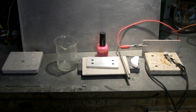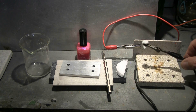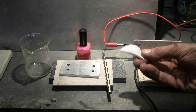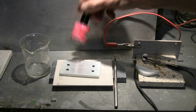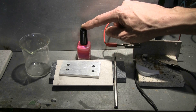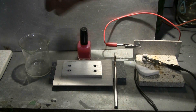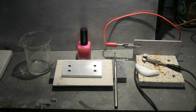In this video I'm going to demonstrate the etching of aluminum. To do this we're going to need a few things: a 12 volt battery charger set up with its negative and positive leads, a cotton pad, a pick, some nail polish to act as an etch resist — it's a very good water resistant lacquer — an aluminum sample piece, and a vinegar and salt mixture in a beaker.